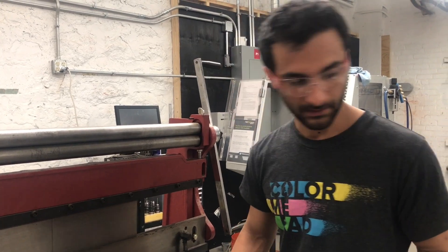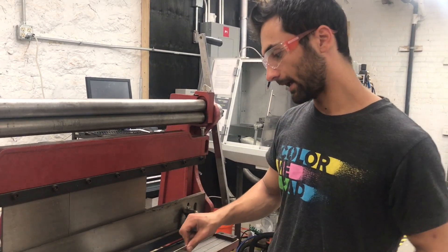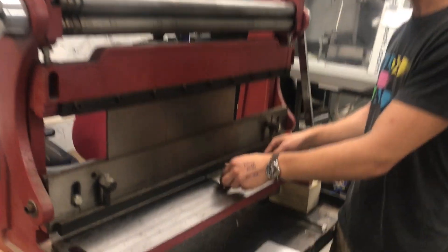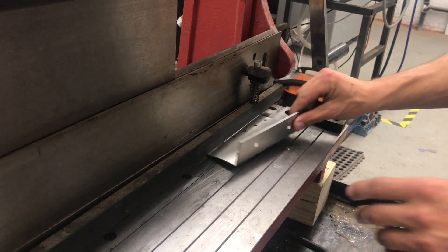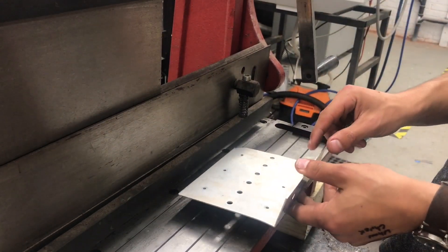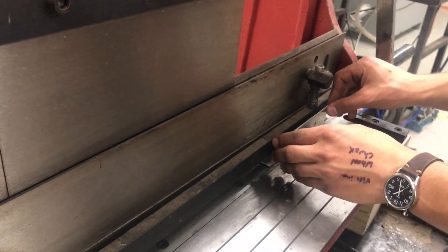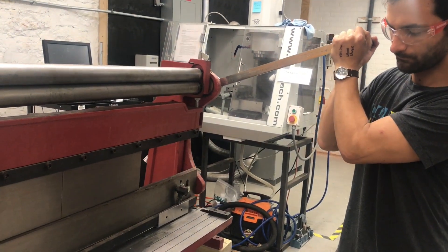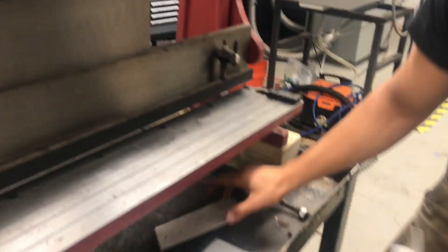And frankly, this piece is a little on the thick side. So what we will do is first see if we can make this cut, and if it doesn't work well then we'll find something better. This bar is used for holding the piece of material down onto this surface — it's also a good way of making sure your fingers don't get in there. This piece of metal helps align it and keeps your piece straight. What I'm trying to do is cut it here so we can use this piece further up. So we'll just line it up here, extend the bar out for a little more leverage, and pull down to snip it, cutting right along that line. And so that's how the shear works.